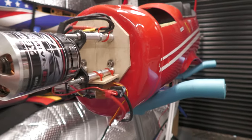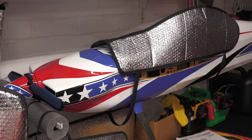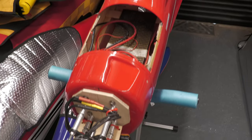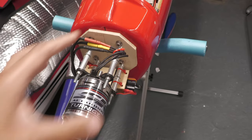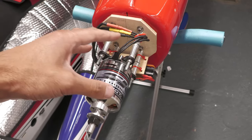All the existing motor and ESC is coming out — the ESC is pretty old, I can't even see what make it is. We're going to put a Castle 160 in there, and the reason is I know that setup works. I use it in a bunch of other models — the Laser over here has an X-Power 35 with the Castle, the NG has an X-Power 40 with the Castle. It's a setup that works and has a lot of power. The motor and ESC are both on order, standoffs on order.